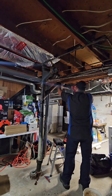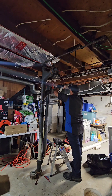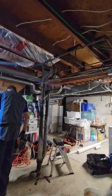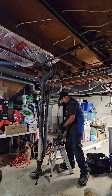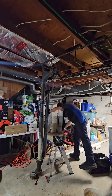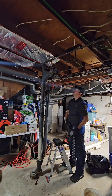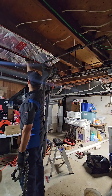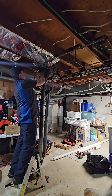I decided to cut out a section of the three-inch copper stack going to the second floor — that's in good shape, we're leaving that alone. We're just here to change the cast iron. I cut that section out of the way and get the snapper ready to cut the vents going up. My guys upstairs are trying to figure out a way to put a riser clamp in there so the vent doesn't fall on us when we snap it.